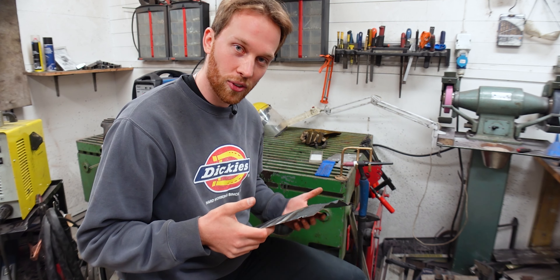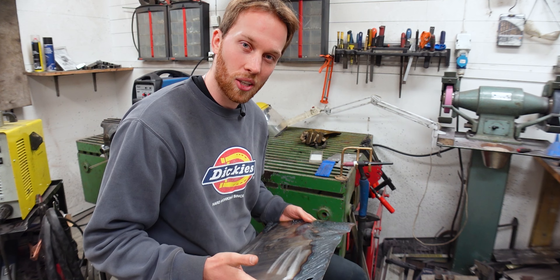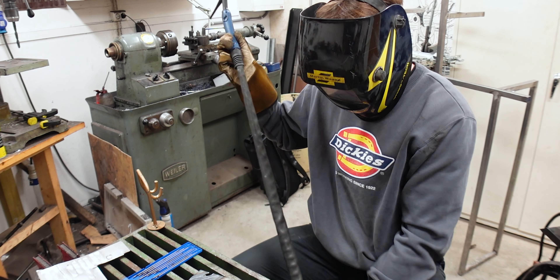To an untrained eye it looks okay, so let's move on and add some filler rod. Adding filler rod was something I struggled with a lot last time — I paid too much attention to it and often dipped the tungsten or both into the weld puddle, and then everything got stuck. Today I want to focus on keeping the weld puddle consistent and moving it along, then just dipping in the filler rod. It's not about getting nice-looking teardrops — that's for the next level. Today I just want to get the basics.